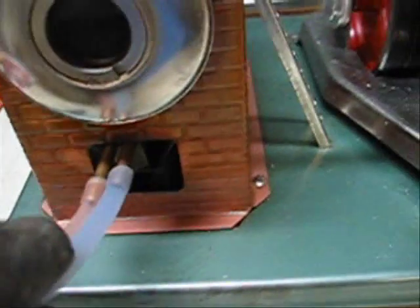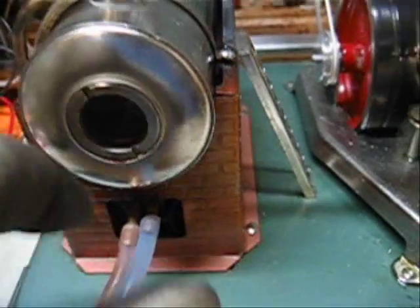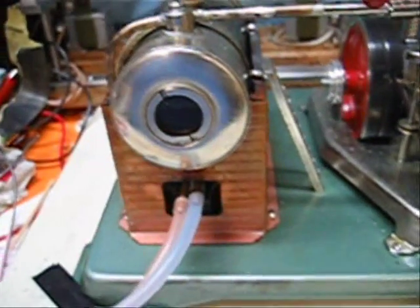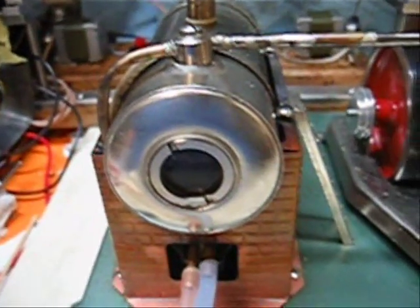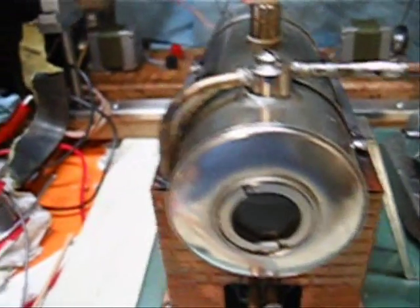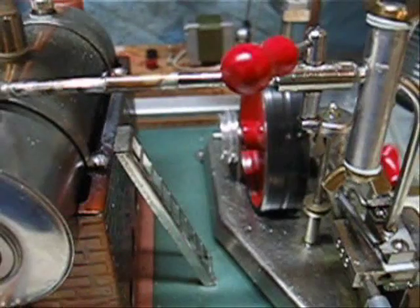Anyway, this burner is still proving to be quite fussy to feed. You cannot just open the tap and let the fuel run free, or it will overflow. You have to watch the bubbles going through the return line and gauge their travel to judge how much fuel to feed into this thing. That's about it for tonight. I think the superheater has some effect. I don't know if it's worth the trouble of building one and ruining the resale value of your engine, but it's an interesting experiment.